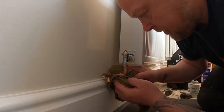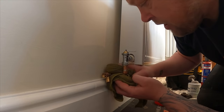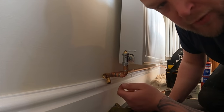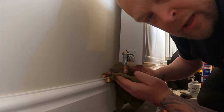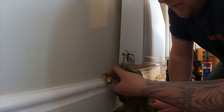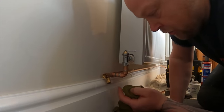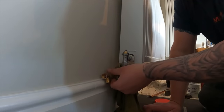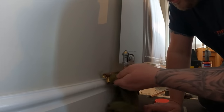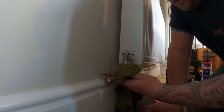Some people will comment that I've not used a burn mat. If you know how heat displacement works through copper pipes, you'll know that you can heat this area up here and the heat will also go into the other fitting, and the capillary action of the solder will pull itself into the joints. I personally like to see a little bit of solder run around so you know it's gone - not for everyone, but that's how I like to do it. Afterwards I'll wipe it all down and it'll look like new again.